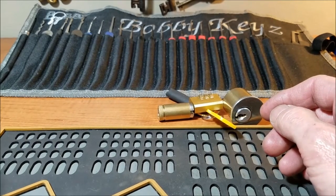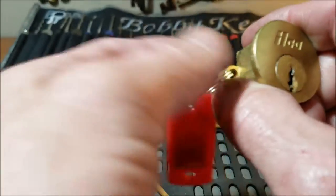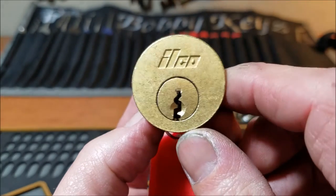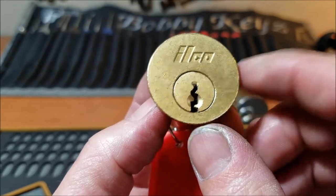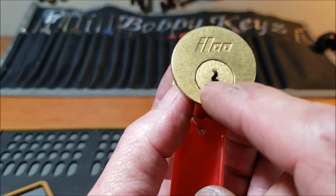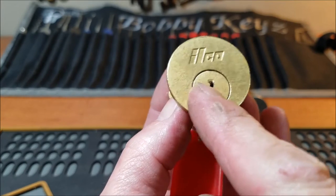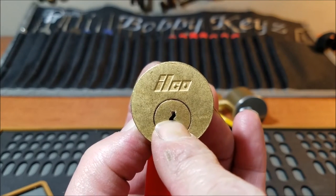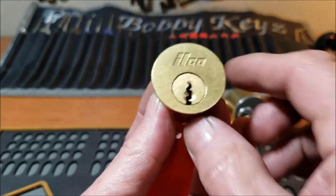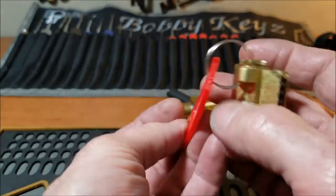Number three is the new addition, and that is from Den Brass — this is from my last trade at ILKO. Look at that keyway — that is probably the most paracentric keyway I've worked with. You've got to go around this warding because the key pins are sitting right on that warding, so you have to go around it and try to get up. I just can't find a pick that I'm comfortable with for picking this Lockwood.